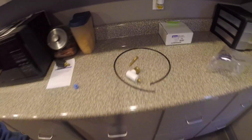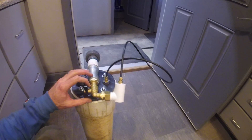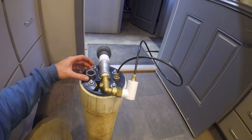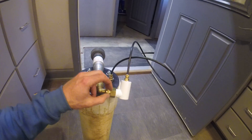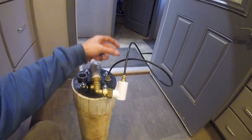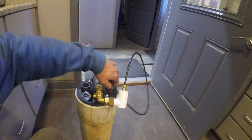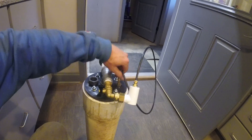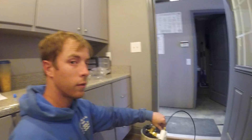I also mocked up an installation so you can see what one would look like. You can rotate this spigot around — this casing is simulating the well head, this is a sanitary well seal, your wire for your pump would be coming out of this hole. The tubing would be cut to length so it didn't have this big loop in it. You can see I've got stainless reducers — a half-inch to a quarter-inch — this just sticks down in the hole and locks on to it.